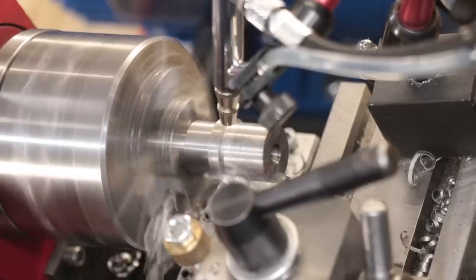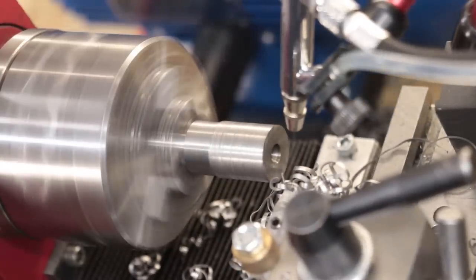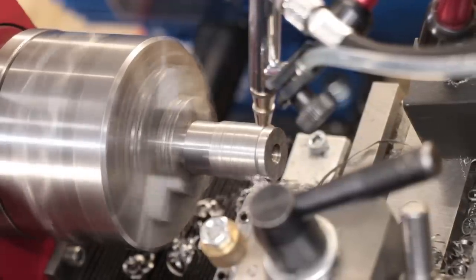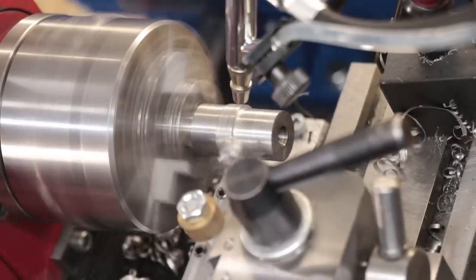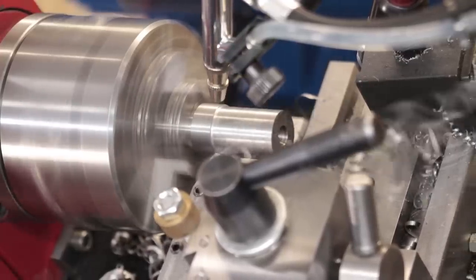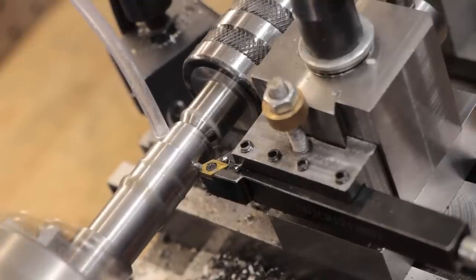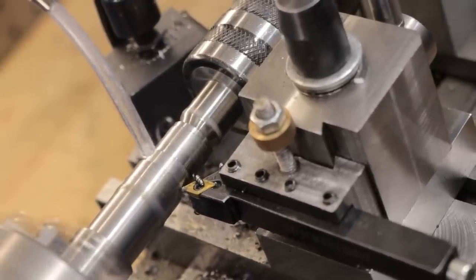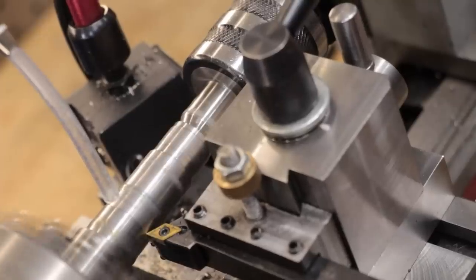On a final note, I want to point out that I'm being very careful with how I position and direct the coolant so that it's sprayed directly onto the part. I've said many times that I'm really not the biggest fan of mist cooling because of the mist that will build up in the workshop — you really don't want to be breathing any of that stuff in. It's really best used with enclosures, which means CNC machines, where you can use an extraction fan and filter. Even though this setup works really well, there is a tiny bit of mist building up. The solution was pretty simple: fitting a small bit of tubing to help collect the mist and turn it into a very controlled stream of coolant. What I might do in the future is fit a custom long nozzle to the airbrush to better control the mist, though that will have to wait because the threads are M5.5 by 0.5 and I'll need a custom tap.